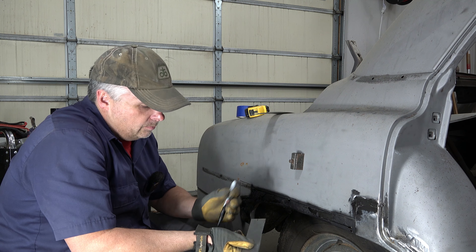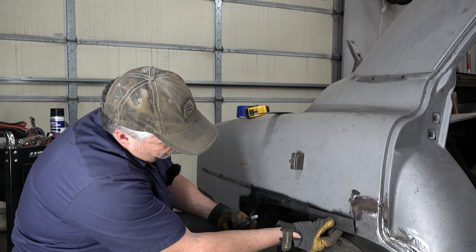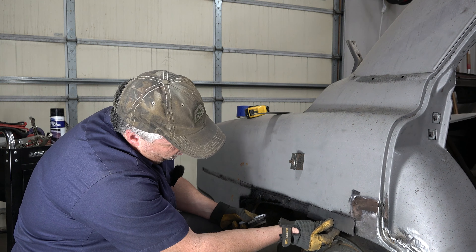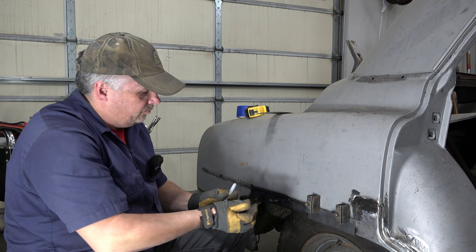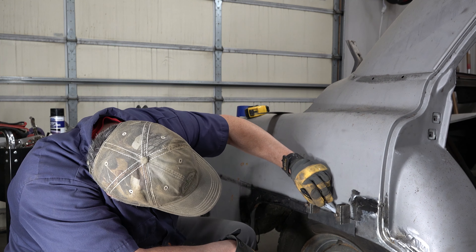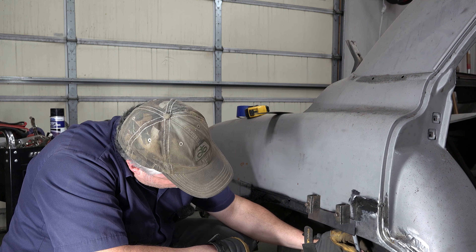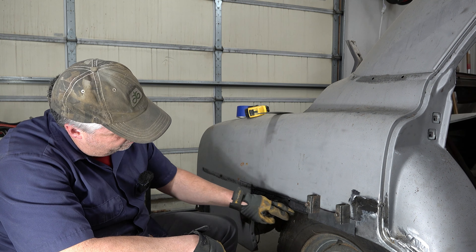I'm going to set this on here. I've got my top line here, which I don't mind trimming out a little more, but I want to make sure I can get my bottom in where it goes. If I face it the right direction, that would be helpful. There we go. Now I can use this to make a final line across the top of the metal here, so I can take my grinder and hit it. I'm a little high and a little long, so let's go on the back side of this sheet, and that's going to bring me pretty much to the base of this edge here.